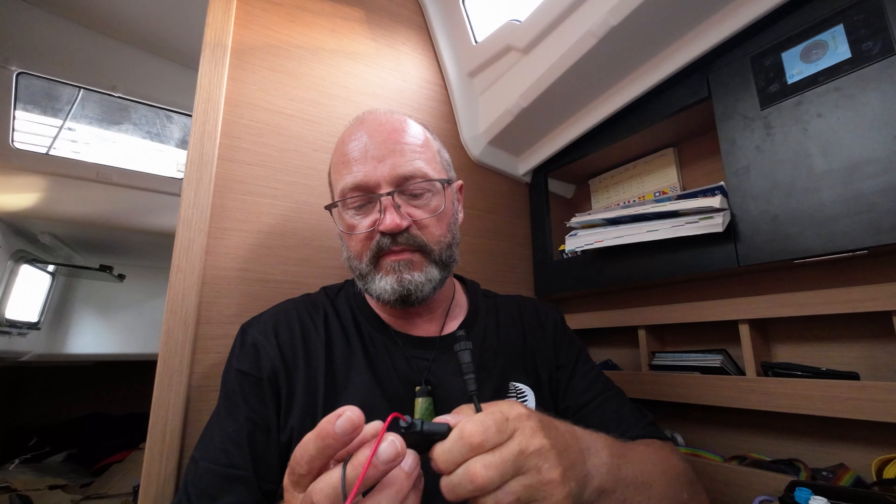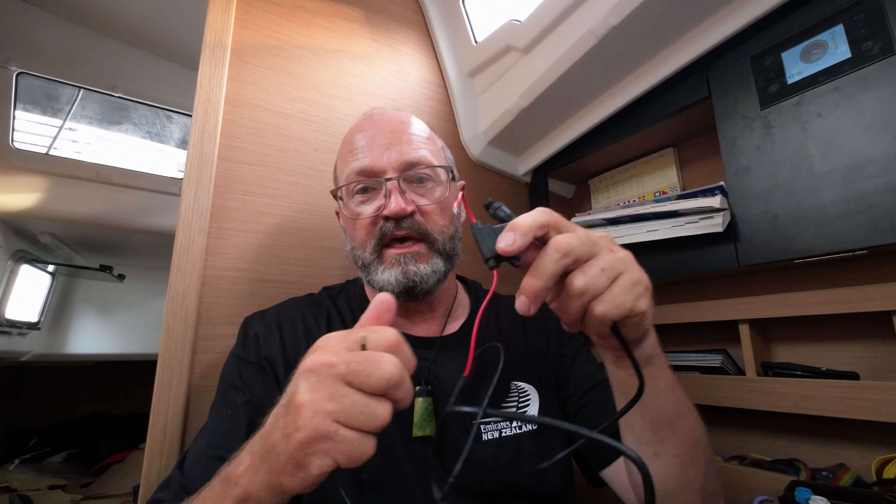So what's the backbone? The backbone is essentially this — a curled up bit of backbone cable. There are connectors at each end of the backbone with a terminator that goes on. When we want to put an instrument in place, we use these little T-connectors and run a drop cable from the T-connector — backbone cable, backbone cable, and a drop cable comes off, which runs to the instrument and plugs into it.